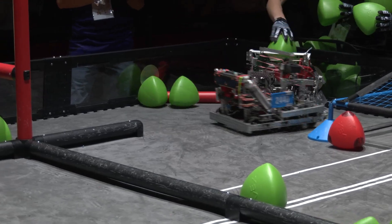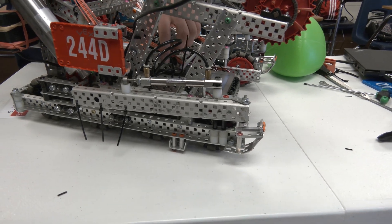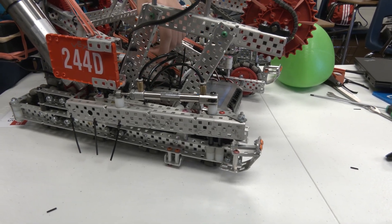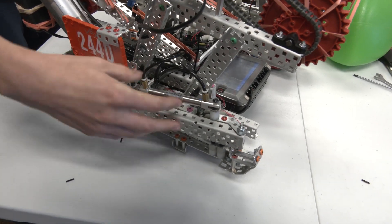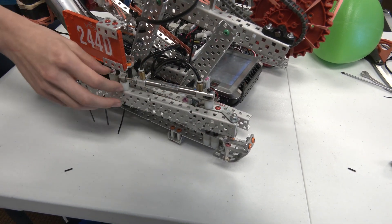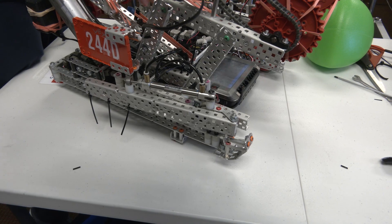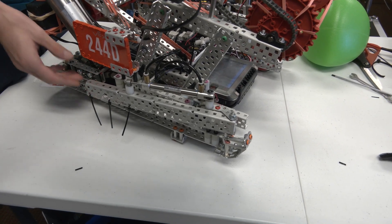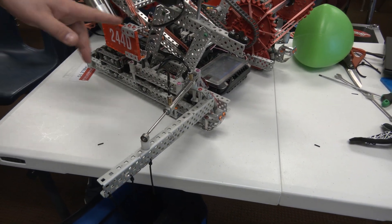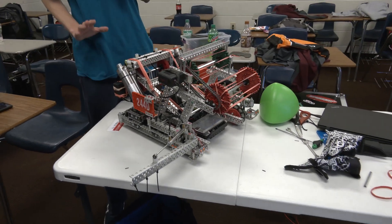Talking about the wings on your robot — you said the way you packaged it was a little bit different than what some other teams are doing. Yeah, a lot of teams are putting this part of the piston inside their drivetrain, but unlike them, we're putting it on the outside towards the front and then directing it to the back of the wing. It just allows for more space inside the robot. Can we see the wings come out and get a little demo of that? Very cool — I really like how you worked with that challenge and came up with a good solution.